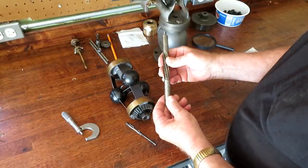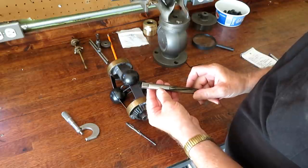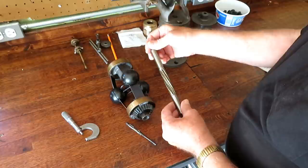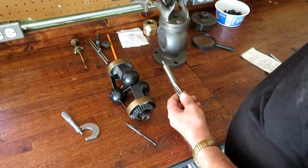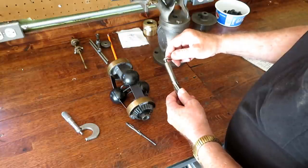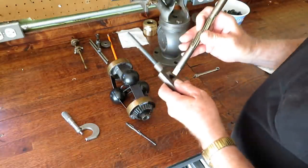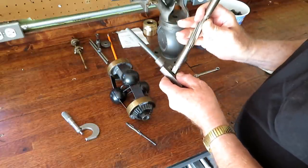And they're nominally numbered. This is 5/8 less minus 1/1000, so that typically would probably be what you'd get if you just touch the screw into there. Well, I'm gonna just tighten it up just a little bit and go through this governor and get a nice fit on the shaft.